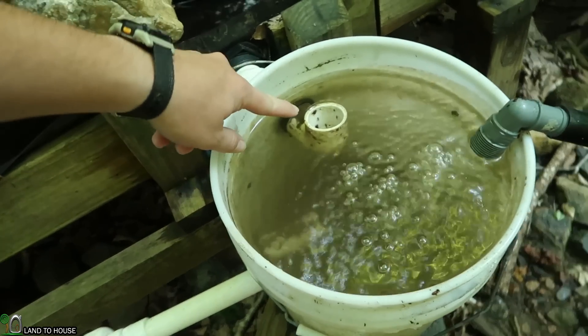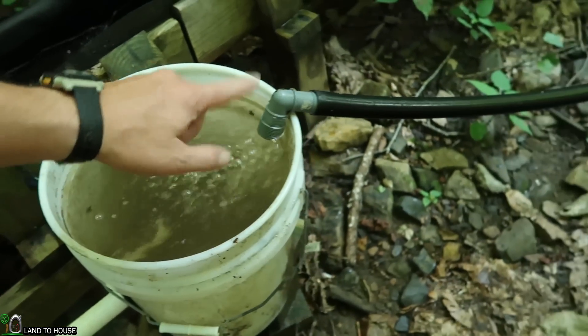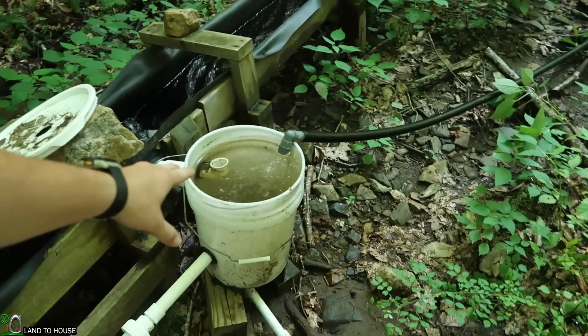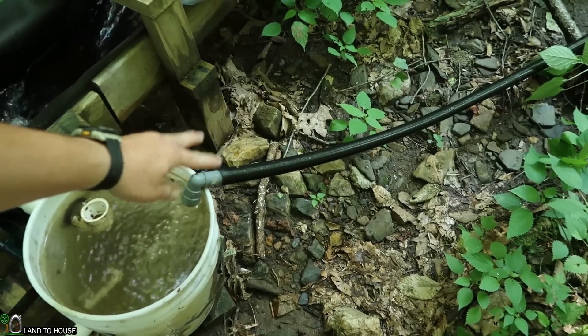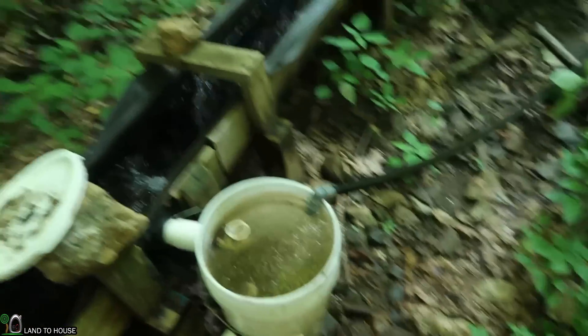As you can see, water is flowing back into my flume here, so I have enough. But as silt and debris clog up my supply line, it's going to reduce that flow. It goes back to the old saying of have a 3-2-1 on your system — meaning you want a larger supply line coming down, feeding an even bigger standpipe or bucket, and then a smaller line going out as a drive pipe. So if I were to increase this pipe to either double one inch or even a one-and-a-quarter inch pipe, I'd be able to bring more water to the bucket.